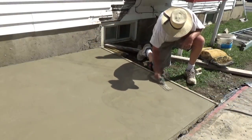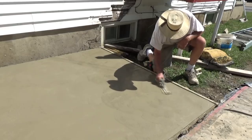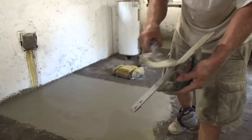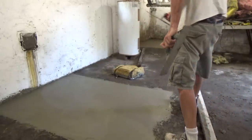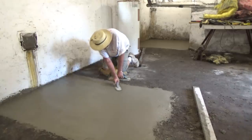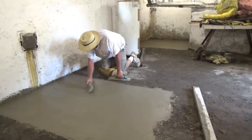It's not long — only about 45 minutes and I'm doing my final coat. It's about 85 degrees out. An hour later I'm all done. On the cellar, when you're doing a smooth finish, you use a smooth finish trowel. See how flat it is? This one's made to give it traction, this one's to make it smooth. You can see the trowels — I'll just finish it up here. That's it, it's all finished.